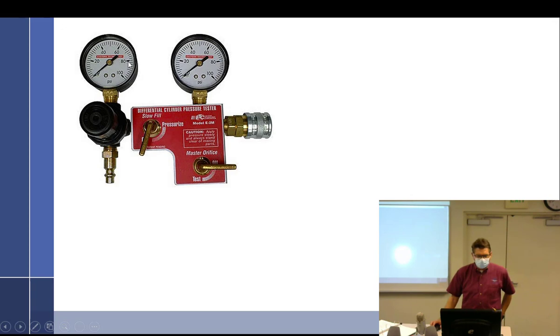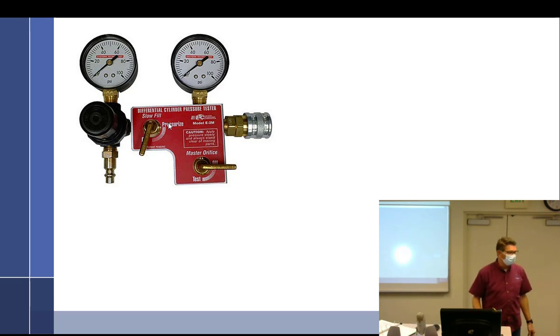But we put 80 pounds of pressure in it, and there's a little orifice here so that the cylinder will slowly fill up. And you're comparing how much the cylinder will hold to how much you put in. So if I put in 80 pounds and it holds 80 pounds, well, I've got no leakage at all. Now, when you guys did your valves, we did it on a bench, so all we're testing is the valves. Well, of course, on an engine, you've got the valves and the rings. So let's just say you're getting 60 over 80, which means you're putting in 80, it's holding 60.